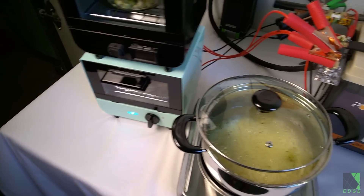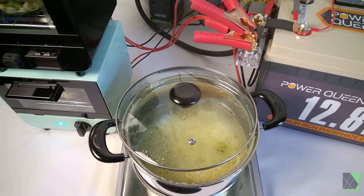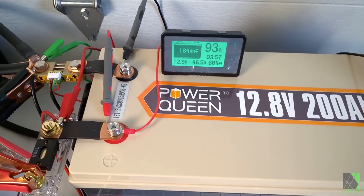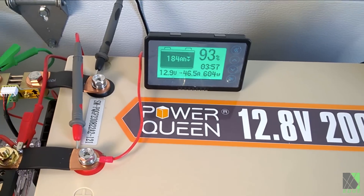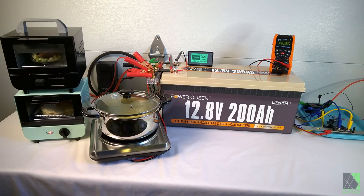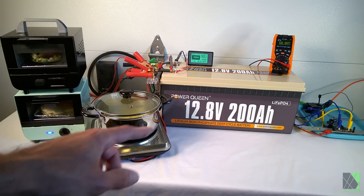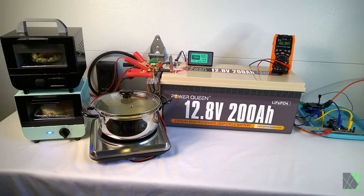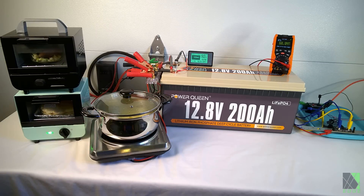The noodles are cooking pretty well, the bread is not quite ready, and the food in that oven isn't quite ready either. Looks like the noodles will be ready first. You can see that the battery is going to run about 3 hours and 57 minutes at this rate, assuming a 200 amp hour capacity. With about 2.5 kilowatt hours of power, you could essentially replace the fuel tank — you can cook using appliances like this, a battery, and some solar panels, using no fuel at all. This is completely renewable and will cook hundreds of meals without burning a single drop of fuel.